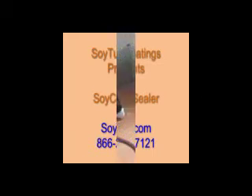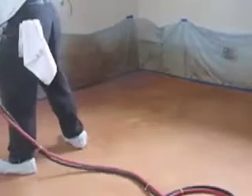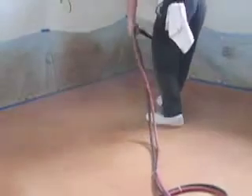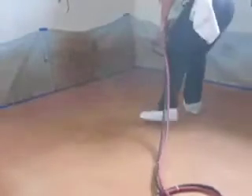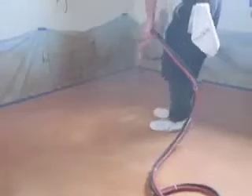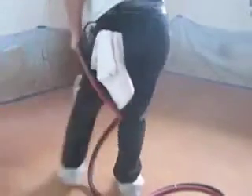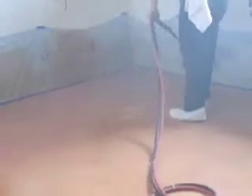The first method you'll see in the photo here — our applicator is using a two and a half gallon pot sprayer. There's about a 25-foot hose, and it'll hold two and a half gallons of material. It's very easy to spray out. The applicator is putting this down in about a two to three mil thickness. We find that it's much easier to do two, maybe three applications of a thinner coat, because if you put it on real thick, you're going to have to back roll it and it just becomes a hassle.